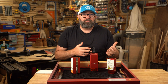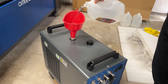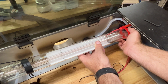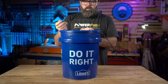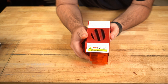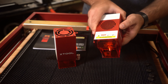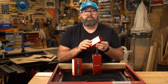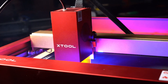The cooling of the machines is also a factor to consider, and this is one reason why I love the D1 Pro. A CO2 laser needs to be water cooled — you either need to pump water through a tube with a laser chiller or a bucket and a pump, which can make the mobility of that unit more challenging. A diode laser is cooled by fans on the unit. On the 20 watt module the fan is on top, and on the 40 watt module there are additional fans on the side. The cooling is literally built into the head of the machine, so it doesn't have any extra components to maintain if you move your machine around the shop.